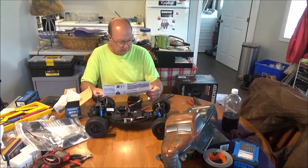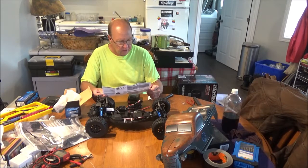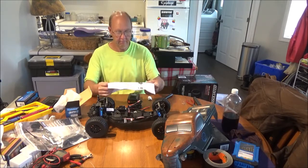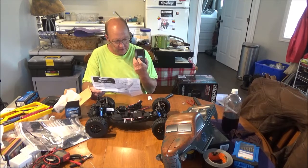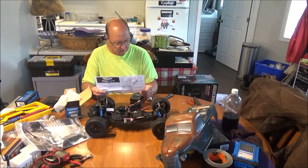Alright, charge status LED. So, we've got cell count 2 to 4. Well, it's actually 1 to 4, but 1 amp, 2 amp, 3 amp selectable. Charge connector is 4mm sockets. And does it say anything here? A lot of things that you should and shouldn't do. Charging procedure. Beginning automatic. Okay, the status LEDs, top row in red, will light up according to how many cells it reads. So that's fine. Charging is complete. The status LED will turn green.